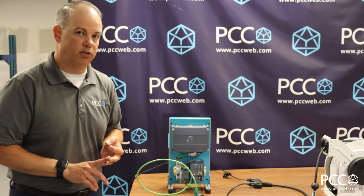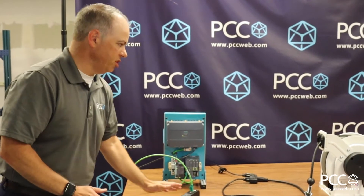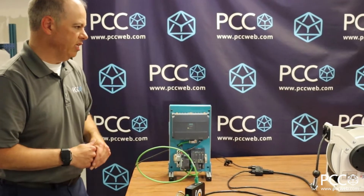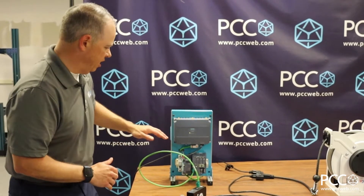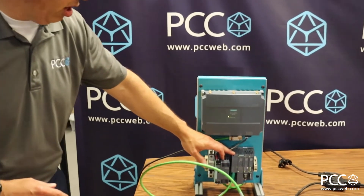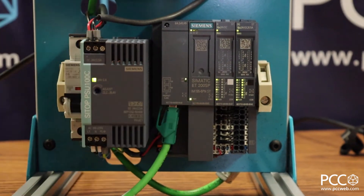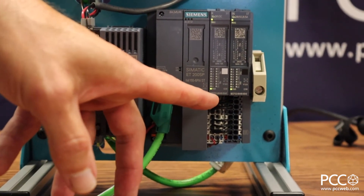I can do this over AC power or DC power without needing separate buses. In this particular demo I don't have specific filters involved, but filters are available to clean the power and ensure a good signal across those slip rings to keep communications intact. If we zoom into the IO station, you can actually see a pattern on my IO — a solid green light and a blinking pattern — indicating that the IO is communicating.